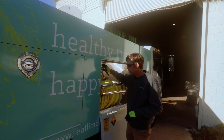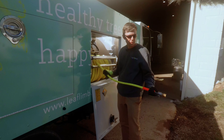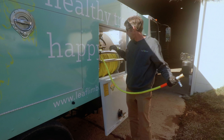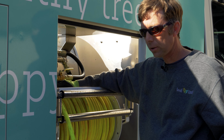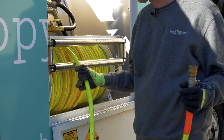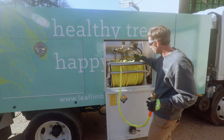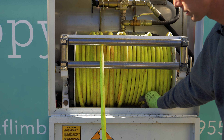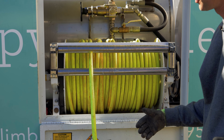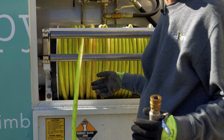While we're over here on this side — we talked about the pressure regulator and the pressure gauge — you have the hose on the same side, which is basically what you're going to use every time you operate the spray truck. There's 400 feet of half-inch hose on here, high-vis yellow so it's visible. There's really no good way to explain how to reel this up — it just takes practice — but you have to get it on there evenly because with 400 feet you don't have much clearance. If you don't get it on straight, it's going to be bunched up on one side.